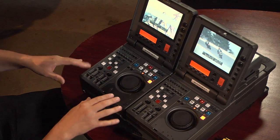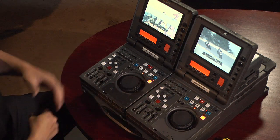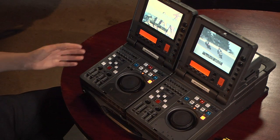So this had a few other advantages that people invented along the way. I had actually used this particular machine to convert composite to SDI digital to get it into a system. They were quite a clever thing for their time. It's got a little audio mixer in it, so you could do all the audio levels and split the tracks. It had 4 audio channels, so you could independently edit each channel if you had to. It wouldn't be very good for a major serious production, but if you're out on the go on a news story, that'd be great.